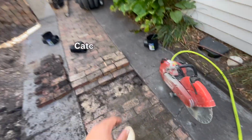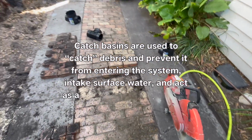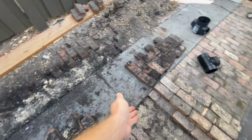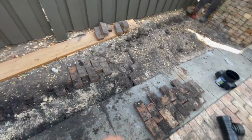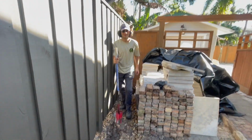This is where we're going to have a catch basin in the low spot right here where it's pooling and sitting for a couple days. So Joe just set up the concrete saw and we're going to be taking out a little bit of concrete right here. That way we can trench it, lay our pipe, and re-pour that cement. They'll tee in, come down the line, where Tristan's having a fun time.